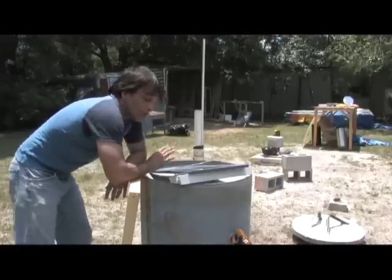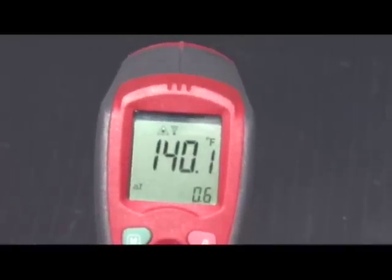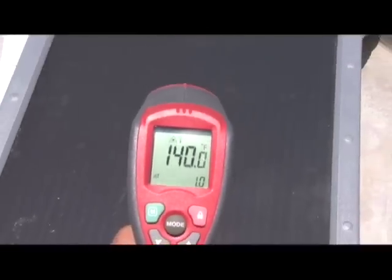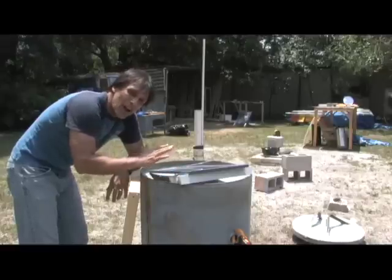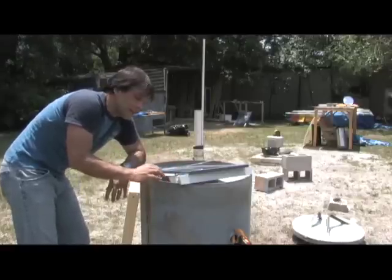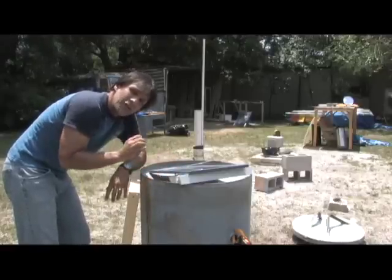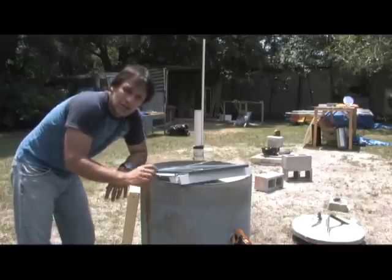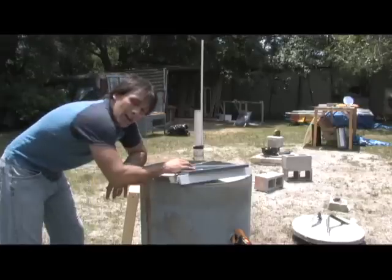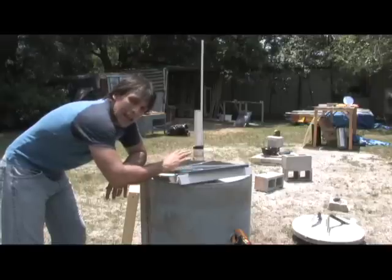One thing you want to keep in mind when doing this is that these solar panels reach about 140 degrees naturally just being out in the sun. When you add a Fresnel lens to it at a shorter focal length like that, the temperature jumps up to around 150 to 155 degrees. So to utilize this there would have to be a way to cool this solar panel down, and that's not that hard to do — there are several ways of doing it. Another thing to keep in mind: you don't want to overdo the output of this solar panel or you could damage the wiring in it. But this does definitely work.